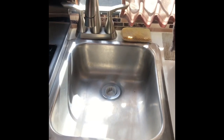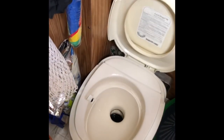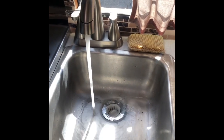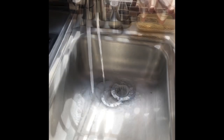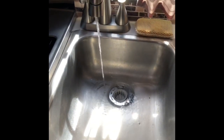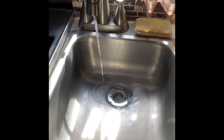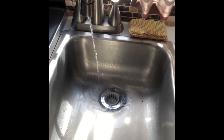Now that it's been three hours, we're going to go ahead and turn on the water and let that go. I'm going to start doing the toilet as well. I'm just going to keep running that until the pump starts running out. Once all the water runs through it, I'm going to go dump it. You can see at this point our pump is starting to cavitate — lines are starting to lose pressure — so that means our fresh water tank is about empty.